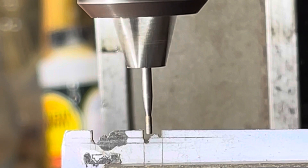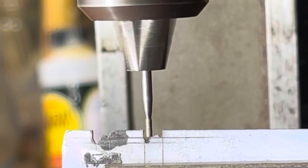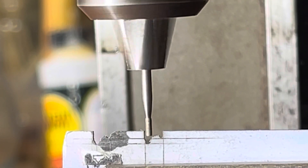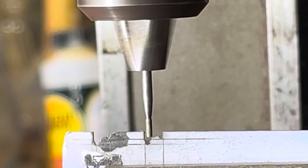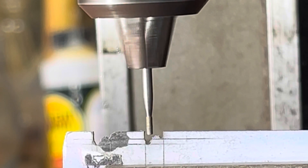Just look at the control that we have. A little brush became very important — I had to clean constantly because the pieces being sanded off kept getting in the way and I couldn't see the clean line. Making cuts in this manner, doing that inside curve was still almost impossible to do with the mill set up this way. So I did go back with the turbo carver to round it off, but that's where those small files — which I'll eventually get — will allow me to do that by hand, with no risk of damaging the piece or making it too big.